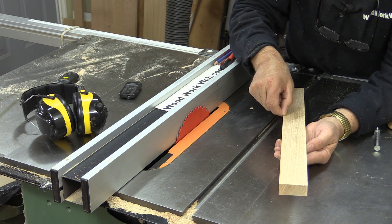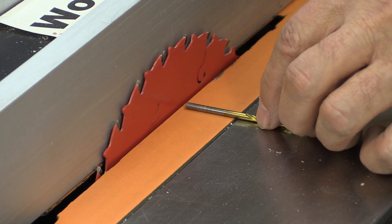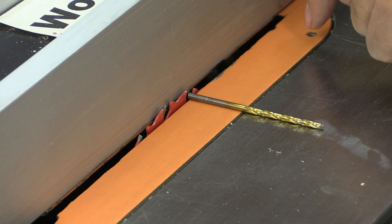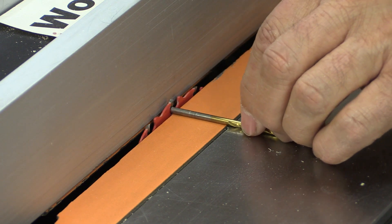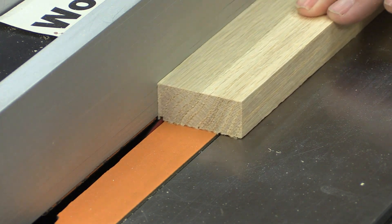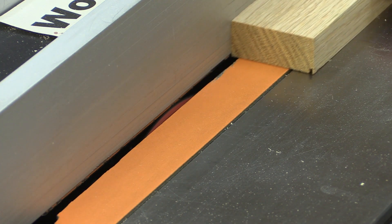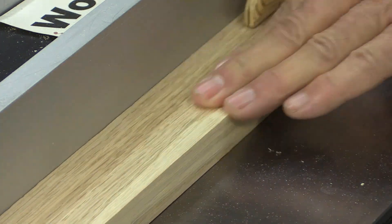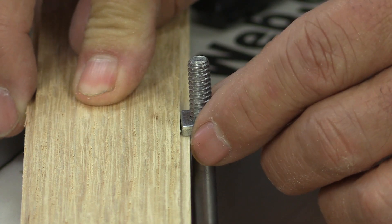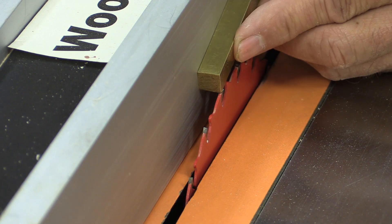Now really all you're going to need for this are some bolts. I like to have bolts where there's thread in one area and no thread in the other, because that's going to replace these pins. This bolt is going to be able to move back and forth. I've got a square nut and I want to recess that square nut inside, and the wing nut will be on top. I've got two pairs of those, and I'm going to use some oak — 21 inches long, three-quarters of an inch wide — and we're going to cut some rabbets to accommodate these square nuts.